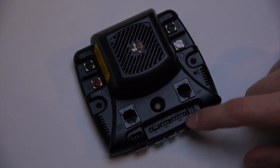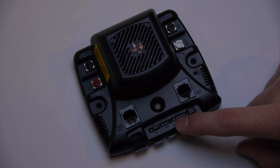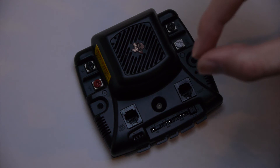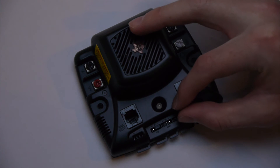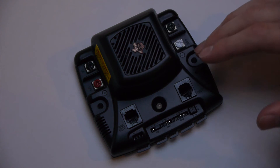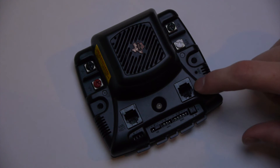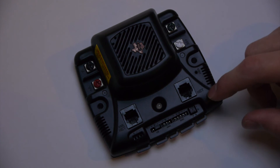The Jaguar can also use closed loop control, which means you can plug an encoder directly into the Jaguar and have it process your encoder values. However, you must use CAN to take advantage of this feature.